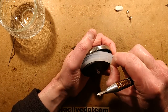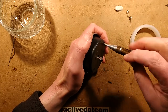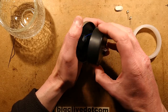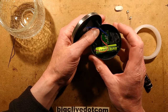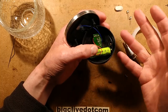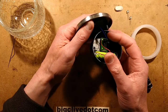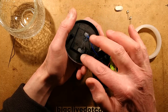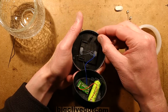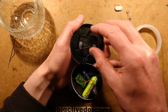Let's peel this rubber seal off. This is kind of modular — it's got this silicone-y rubber seal and the housing here. It's got a very ungenerous 100 mAh AA cell, which will do — it's all that's needed, although I think that could be upgraded because that's a fairly generous solar panel. The solar panel is well glued in with hot glue. And this looks like it's pressed in and latched — it doesn't look like the metal has been crimped around it; it looks like that's been pre-crimped and then this has been snapped in.